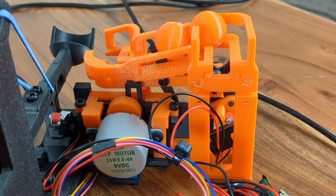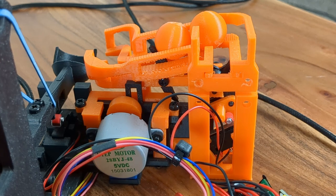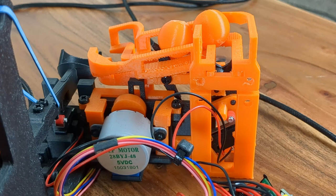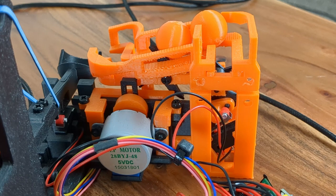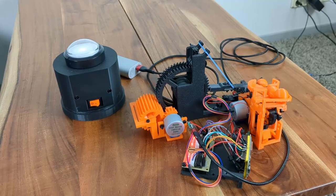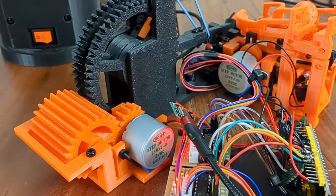There was also a challenge to balance out the power and speed of the small stepper motors. With a higher gear ratio, they were too slow, and if I decrease the gear ratio, all the power is gone. If I was designing this again, I would probably use different motors for the project. All that is left is to see the final shots and see if this actually can be a candy feeding machine.